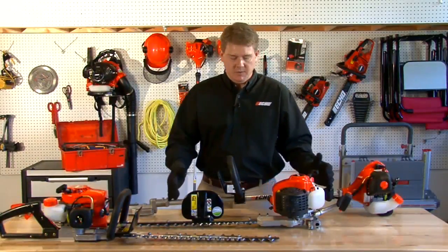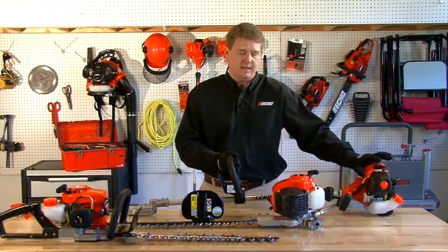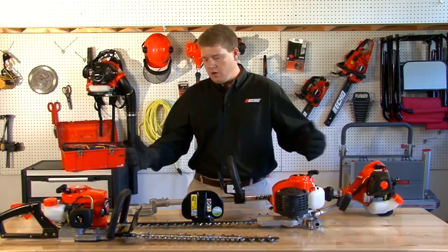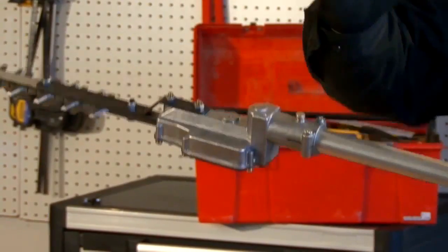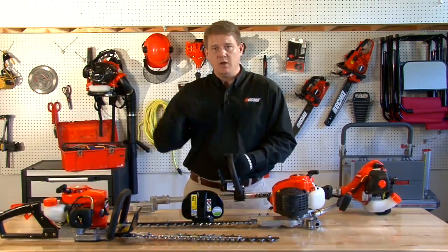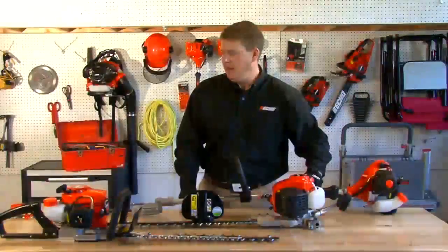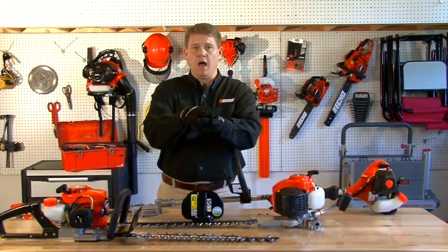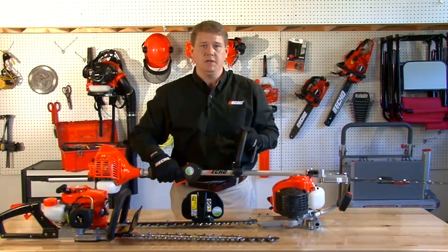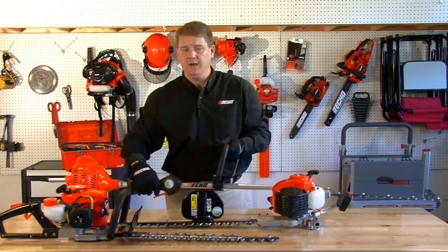We also have a shafted hedge trimmer. You want to think about your application for a shafted hedge trimmer — they come in various cc and displacement engine sizes. You can pick the shaft length from shorter to longer. This one is a fixed gear case, but you can also get an articulating gear case which will rotate 180 degrees so you can cut a 90-degree angle on a tall hedge. This model comes with a 20-inch reciprocating blade, meaning the blades move in parallel opposite directions. The advantage with an extended reach hedge trimmer is you can reach extended lengths much more than with a single-sided or double-sided.